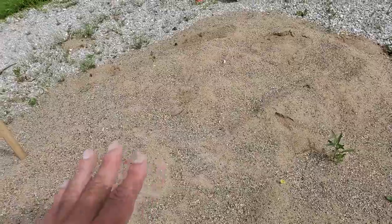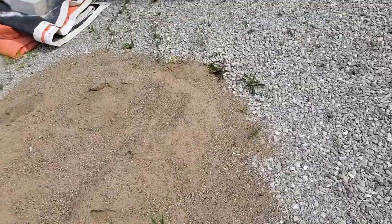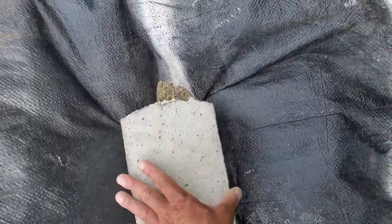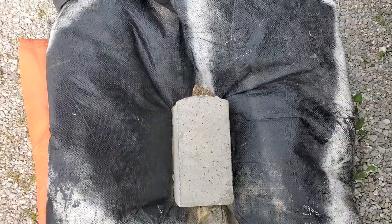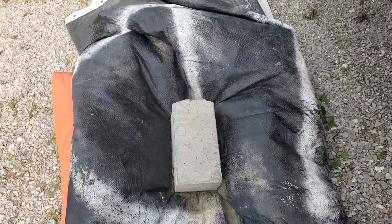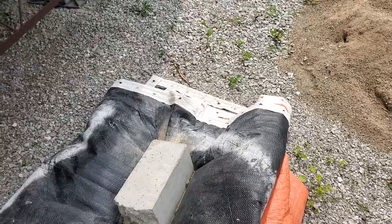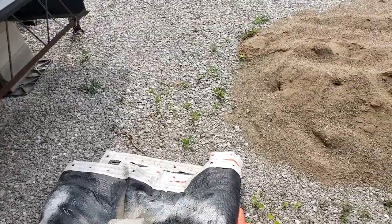Now, this sand is what we use when we make beams. Let me show you what a beam looks like after it's been broken. This is a concrete beam right here. Generally, when we have a lot of concrete, now in Indiana we use cylinders sometimes, but they love using beams. Now, this is a beam that's been broken. Beams are basically used for flexural tests, and a flexural test would be if they were using precast concrete beams on bridges.